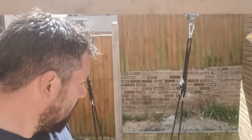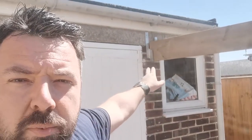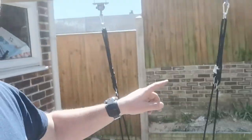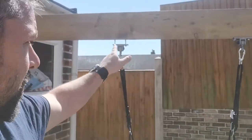Hello ladies and gentlemen, just doing a quick video on something I bought off eBay - I'm installing a swing for a customer. It's quite low but we had to deal with various constraints. It's got a slight rise on one side because I wanted to make sure my joist hanger bracket was going into the pointing as well to give extra hold. The thing I bought on eBay was the swing and these hooks, and they're not quite as easy to install as you might think - there's a little bit of a trick to it.